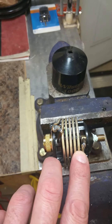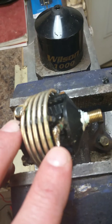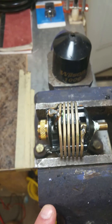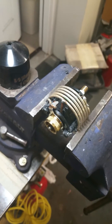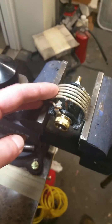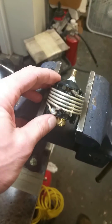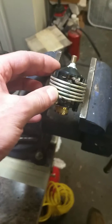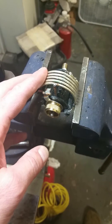Both times it happened to be this solder joint right here that broke on me. I know a lot of my old posts have people trying to get an ohms test on an antenna, and some say you shouldn't check for ohms. I can see that if you're checking SWR, that's a different story, but if you're checking the antenna itself to see if you have an open circuit, that's valid.